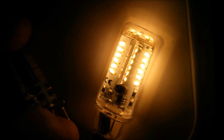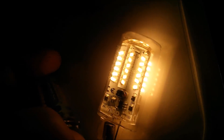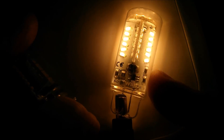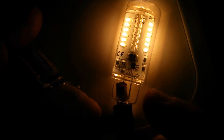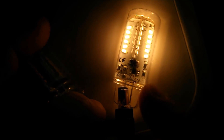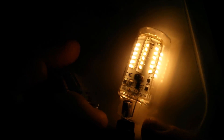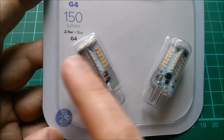The exposure is locked. There it is, all lit up — all 57-something LEDs and all the electronics. Quite a few of these components are diodes, and we need those diodes because on bulbs there's no concept of polarity, so you have to be able to let people plug this in either way around. The diodes — presumably in a bridge rectifier formation — handle the polarity issue.